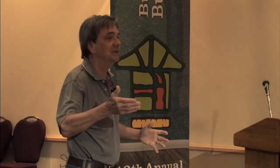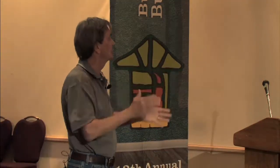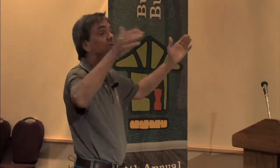But the ERV, you don't want in a house that's too humid. You want the drying effect of the HRV because it's really going to help you out to drop that humidity. And when you have a house that only has 2 people left in it and they don't have a lot of family that come and eat all the time, maybe their house is too dry, then the ERV is the proper one.